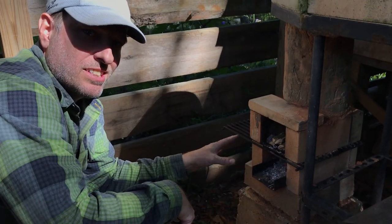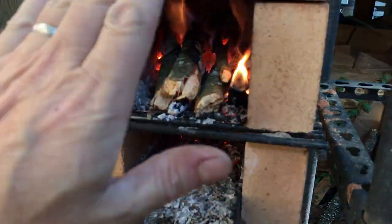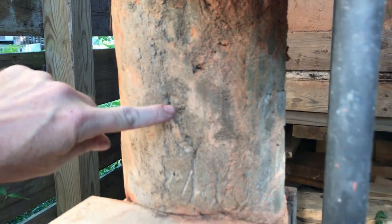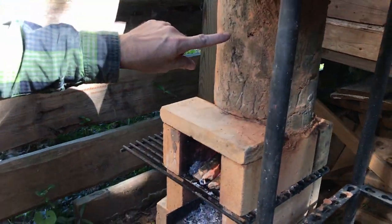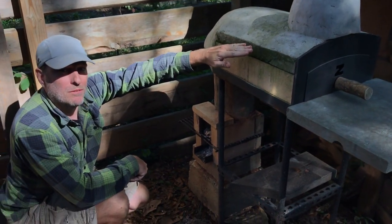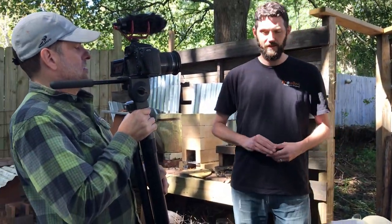The back of the oven is actually a rocket stove. There's a firebox here with a grate that elevates the fuel, and air comes underneath up through the fuel, giving a smokeless boosted burn. This riser is made out of lava rock and stove mortar — there's about a thousand degrees in this firebox, but the outside is only about 185 degrees, showing how well it insulates. The fire curves up the back of the oven, travels across the top where we have the rebar arch, and out the top.